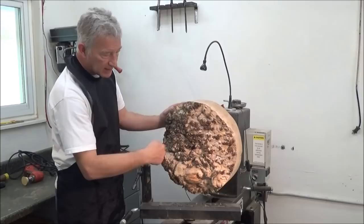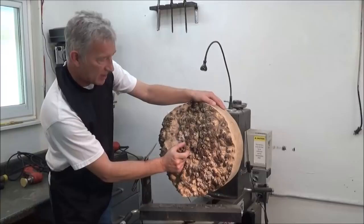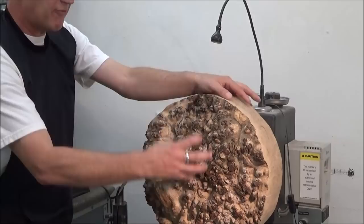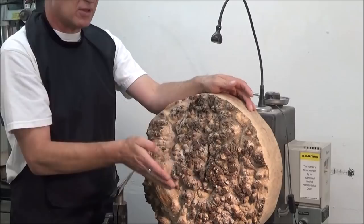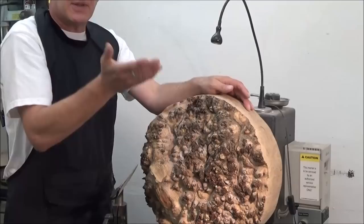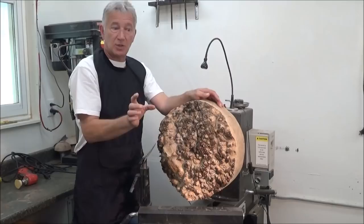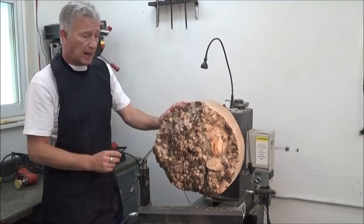After that, we're going to take this away. I've got to go right down to the bottom — roughly an inch and a half to get to a flat surface, which I can then put the foot on. Once I've got the foot and the reference of where the foot's going to be, I've got the diameter and two points of reference to form the curve I want. The foot's going to be slightly lifted — I want a slight lifting curve, then a kind of return curve, just a simple curve. It's going to have a wider rim which is going to be undercut.